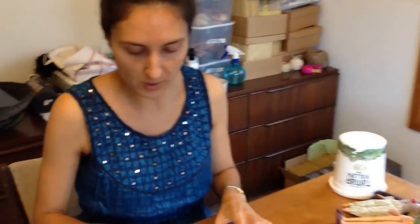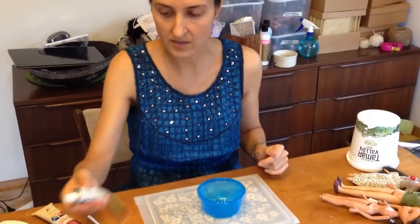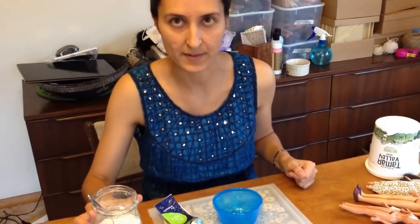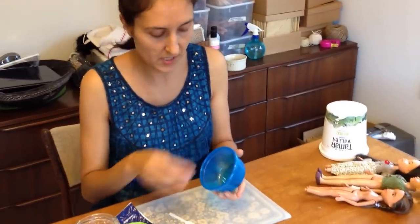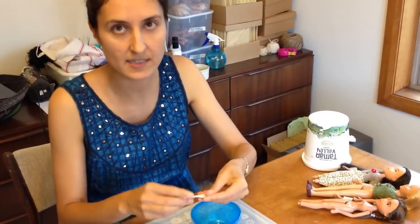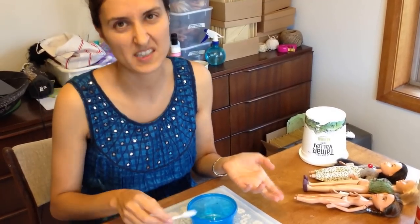What I'm going to be using to make this homemade moldable silicone is my tube of silicone caulk, some paint to colour it, and cornflour mixed in. I've got a little plastic bowl — this stuff can be peeled back from the bowl so I just reuse my plastic bowls and this little plastic spatula, but you can use a paddle pop stick or a plastic spoon.